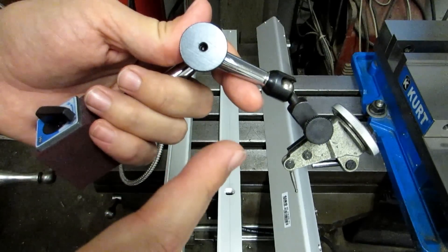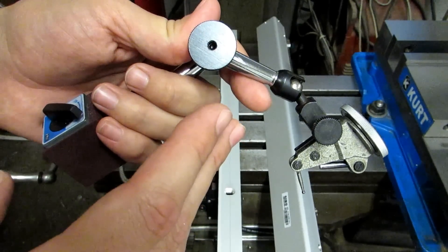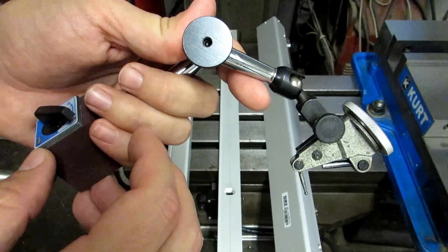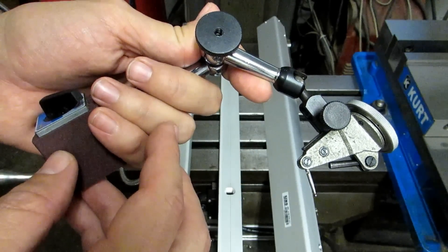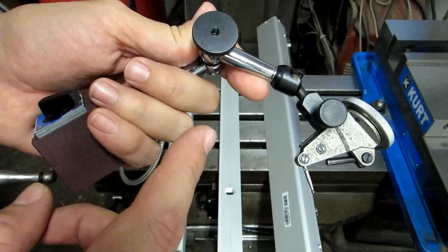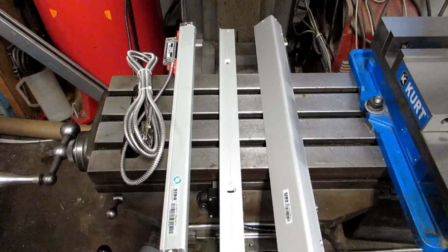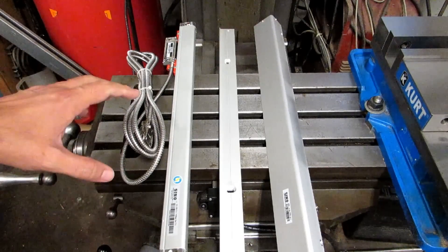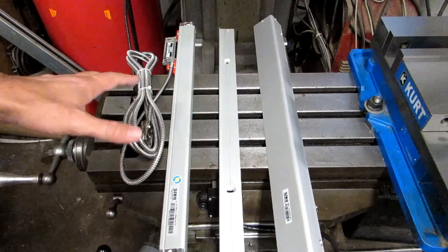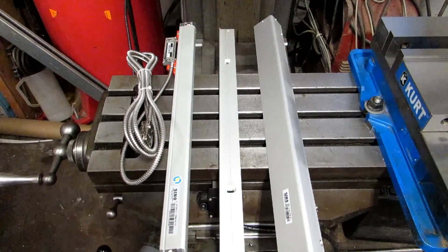Take your time during the installation and make sure that the scales are really dialed in — that's going to make your job a lot easier later on when it comes to linear compensation. One last thing about dialing them in: you've got to dial them in in two directions, up and down and side to side, to make sure you don't have any angular error in your scale. That pretty much sums up the general info for installing the DRO, and anything specific to each scale I'll cover in that scale's video. Thanks for watching — I'll see you next time.